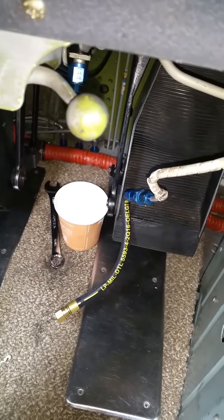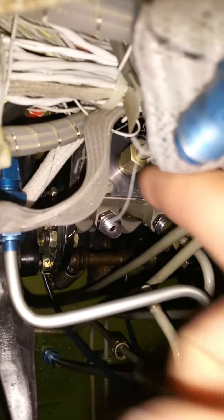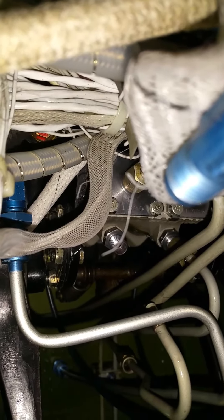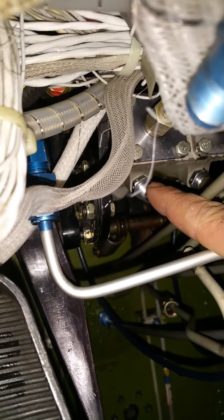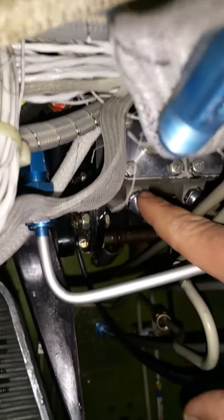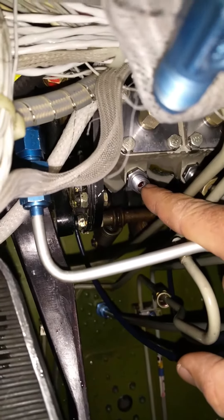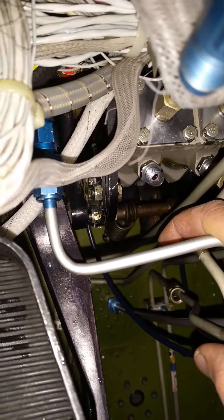There's been some question about how we troubleshot down to a bad brake pedal actuator. Here's what we're seeing: if you look at the brake pedal actuator, this port here is for the right brake pedal going to the emergency brakes, and this port is the left brake pedal going to the emergency brakes. This port should have pressure whether you're in emergency or normal mode — when you push the brake pedal, both the normal port and the emergency port should produce brake fluid, which goes down to the brake distributor. Depending on where you have your brake pedal, that tells it to use either system one or system two.